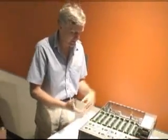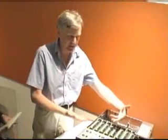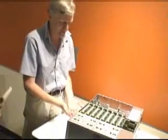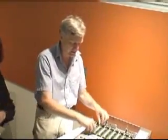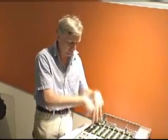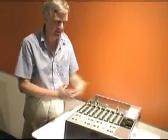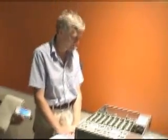Well, the thing is, you have to keep the HyperTransport links that go between the CPUs as short as possible. So the HyperTransport is actually on the motherboard. So it's not a bus, it's point-to-point connectivity, but the HyperTransport runs on the motherboard, and each CPU plugs directly with 3 HyperTransport ports into that structure. So all the wiring is underneath here. HyperTransport is on the underneath. Right, that connects all 8 of these. Gotcha. And to the I/O.